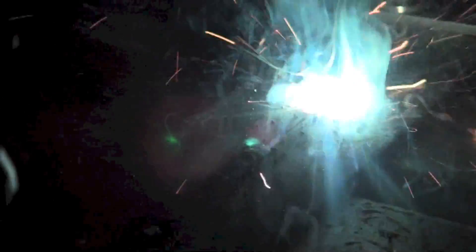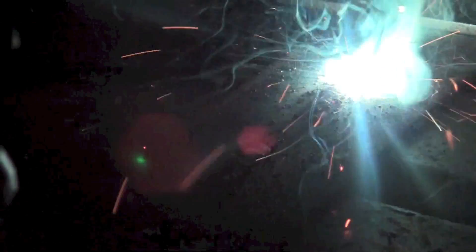If I were to make those marks with something like a paint stick, a sharpie marker, a scribe, or some other tool, it's very difficult to see that with my welding hood on. By marking it with soapstone it'll stay there even when the metal gets almost red hot. So this is the best method for marking skip welds.